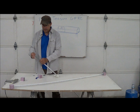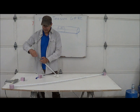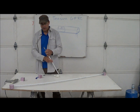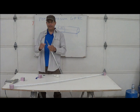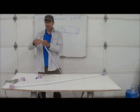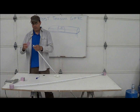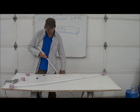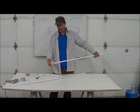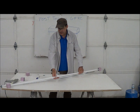You pre-attach washers and a nut. You want to make sure you leave a little bit of rod past the nut, because when we go to post-tension, we're actually going to grab this with a piece of vise grips and turn it — otherwise the entire rod will try to twist. Then you make a little block-out and put it on. When you strip, here's your tendon that's going to go in the piece. We'll strip this block-out, grab the end, tension it — that'll give our piece tension.